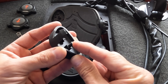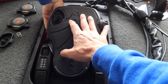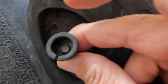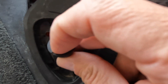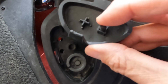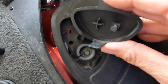This is the little piece that, when you press your foot pedal down, engages your momentary switch. Inside there you'll see the little magnetic piece sticking up. Sometimes that piece will get pushed down and be recessed or flush, and then it won't make contact. Or sometimes it'll get pushed up too much and make constant contact, so your trolling motor won't shut off, or you'll have to double-tap the switch to get it to shut off.